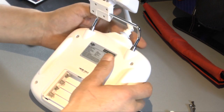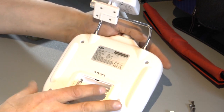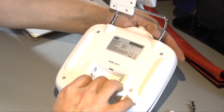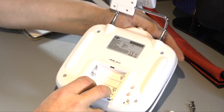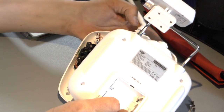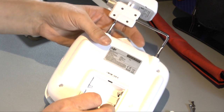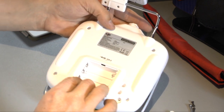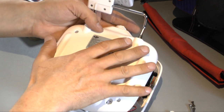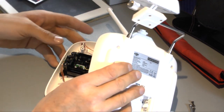Therefore, hold your thumb on the antenna and press it to the front cover, hold the cover with your other hand, and then move the back cover up a little bit and pull it out very slowly, and you will see it comes off the antenna here. Here we are. Do it very slowly, don't be too fast. Move the back cover a little bit, shake it a little bit, pull it a little outward, a little upwards, and then it will come out after a while. When you do it the first time, take your time and don't be too fast.